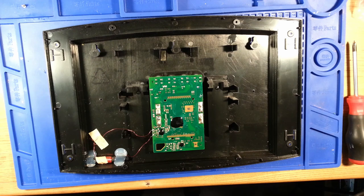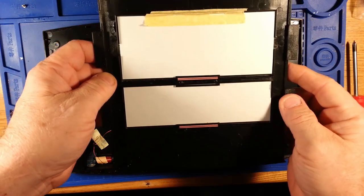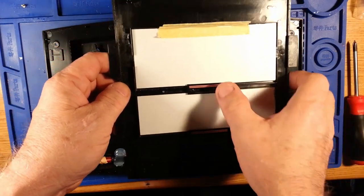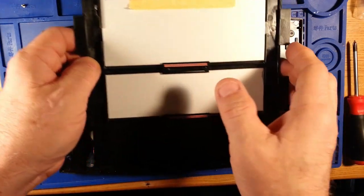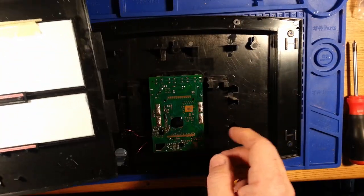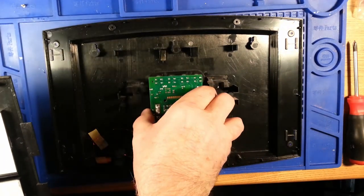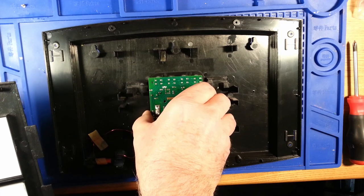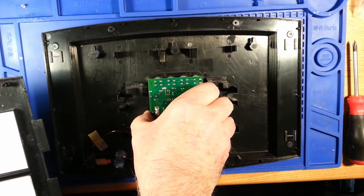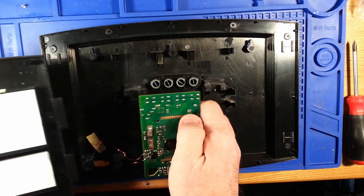Taking things apart is usually nowhere near as complicated as putting them back together. I finally remembered that the LCD assemblies have the two zebra strips. They have four mounting holes that this board mounts onto, and you also have to make a good contact with. So this assembly has to be screwed onto this board first.